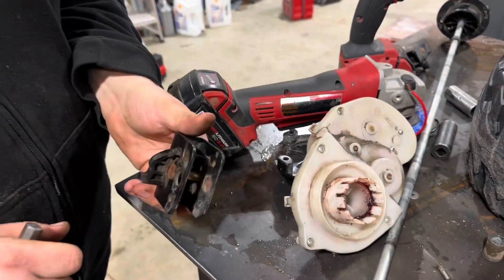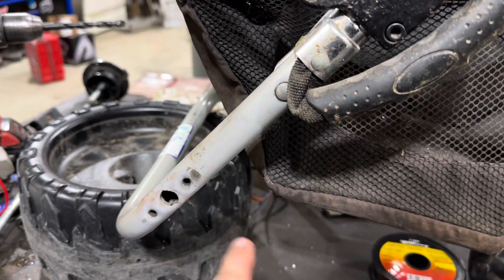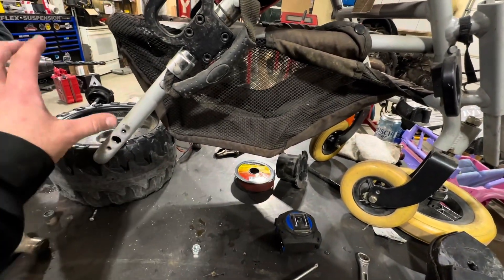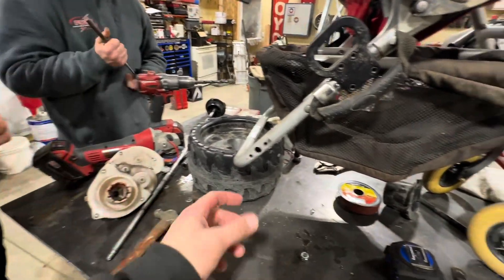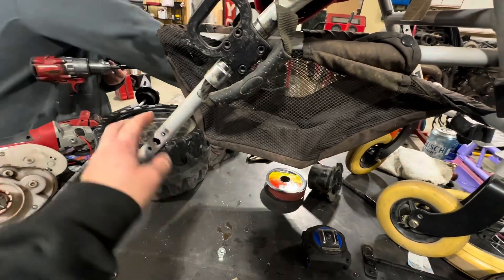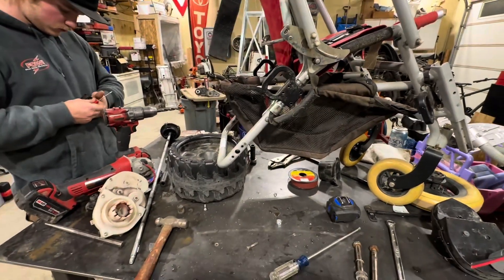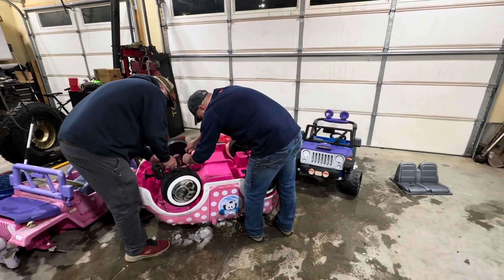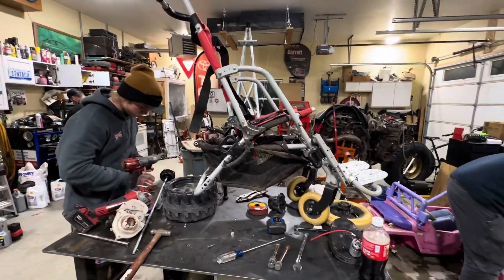We're trying to gut this little bracket. The bracket was here facing this way, which forced us to put our motors facing forward, but then the motor hangs way too close to the ground. We really want the motor facing backwards like on Orb number one, so we had to knock that bracket out, remove the extra hardware from the brake system, remount the bracket the other direction, re-rivet it into place, and then put the axle through with the motors sticking upward on the back. Meanwhile others are gutting extra carts for parts.